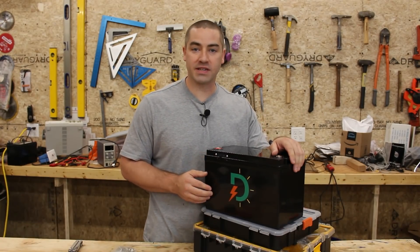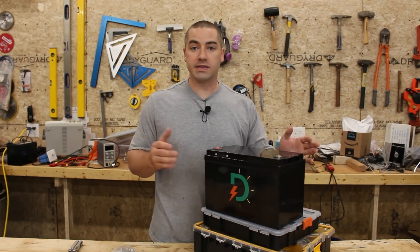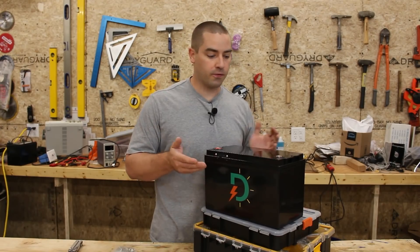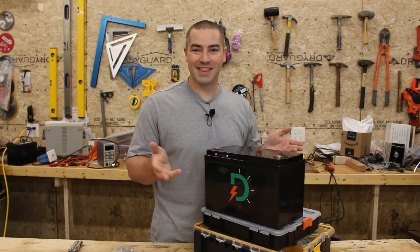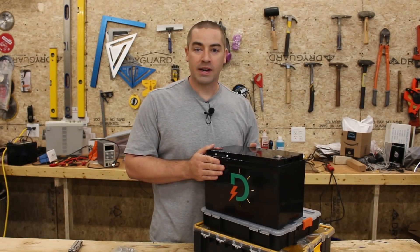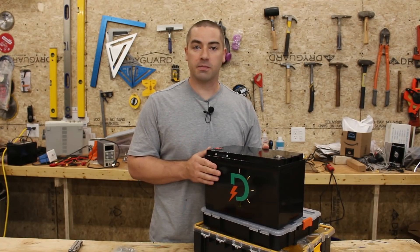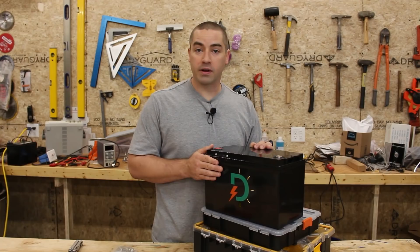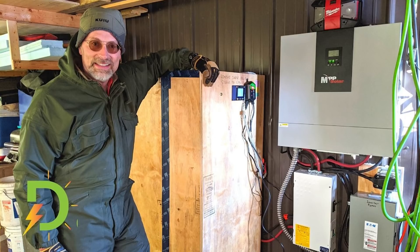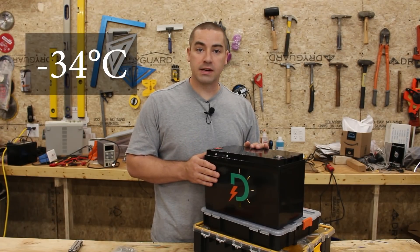The last question I'd like to address is: does the BMS have a low temperature cutoff? I'm not sure why I've received this question so often because my garage is a heated garage, but if your application calls for having this in an unconditioned space and you're charging it during winter, then yes, a low temperature cutoff might be important to you. I would advocate having controls in place to keep this battery inside a heated enclosure if it's going to be in a cold environment — I think that is more important than whether the BMS has a low temperature cutoff. I'll leave a link to my friend Bill's project, who built his own heated battery box that keeps his batteries at 50°F all winter, even in Vermont where it gets to negative 30°F.